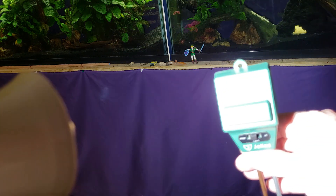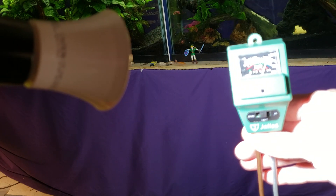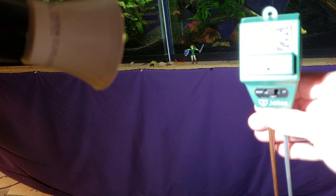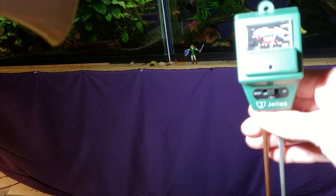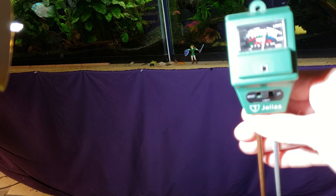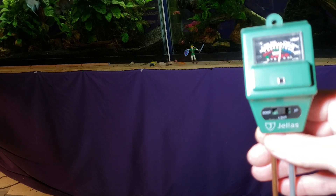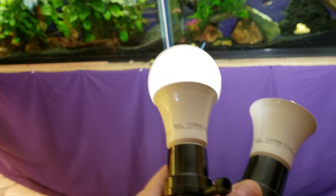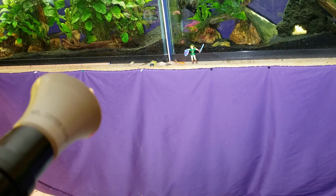This is the exact same bulb with the diffuser broken off. At roughly the same distance — even angled slightly away from the light — you can still see we're getting about three quarters of the way up. Remember, I had the same level of light at almost three feet away from my other LED, so we're not talking about that kind of comparison. But comparing how much light gets on your plants with the diffuser blocking so much of the light versus those naked chips shining light directly on your plants, it makes an enormous difference. That's why I'm stripping these down.